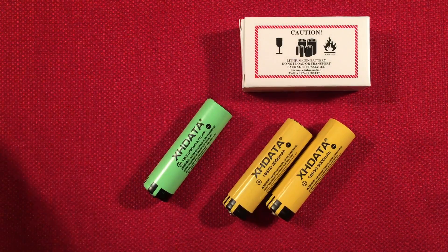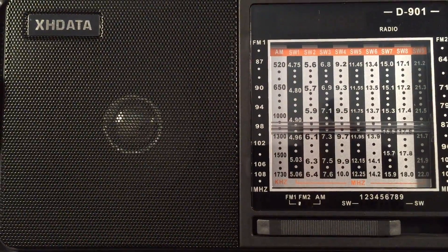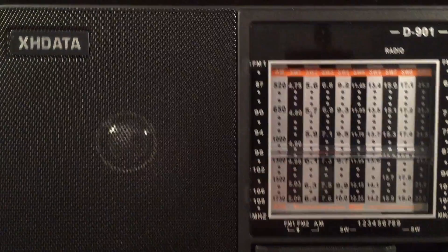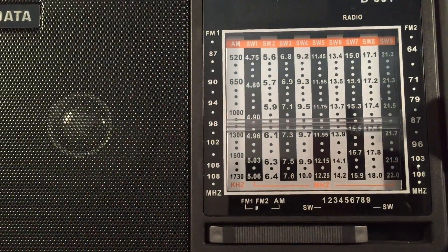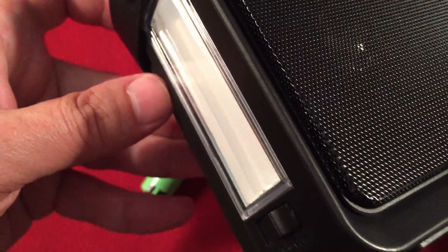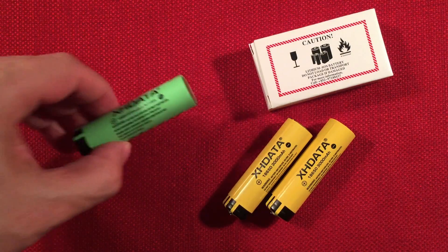The last battery came out of my D901, which had similar capacity to the D368. The D901 is an awesome radio — it can be had for under $25 and it's a beast. Look how big this thing is. It runs on D-cells or an 18650 unprotected button top. It's got a media player, Bluetooth, MP3 player, Type-C rechargeable, auxiliary antenna input, and it picks up shortwave, AM, and FM fantastic — with a flashlight on one side. Its battery came in at 1,538 mAh and dropped to 3.9 volts, so something you're going to want to replace.